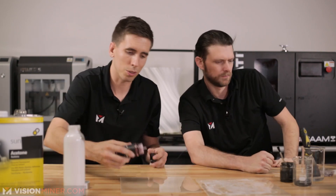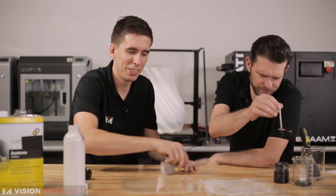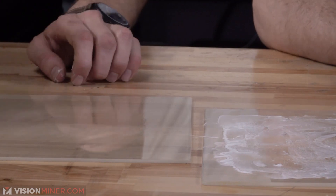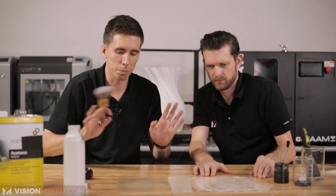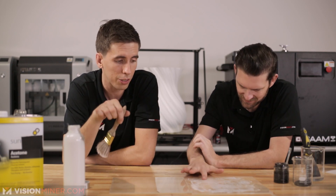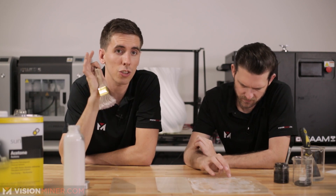It's a lot easier to just grab a nano polymer adhesive, which makes it super easy - you can do multiple prints. You apply a little bit, take any brush, wipe it around with a paper towel. It's alcohol-based so there's a little fume but that's it. That was a lot easier, and it's perfectly smooth - your parts are going to have a totally mirror bottom finish and you won't have to use brims or rafts. We don't use any brims at all anymore.